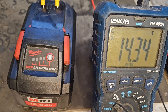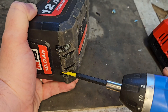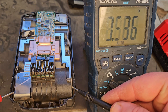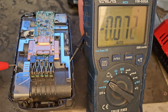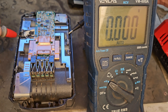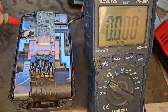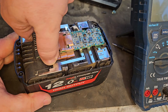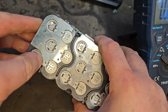The battery is showing a none-too-impressive 14.34 volts. On the first bank of cells to the other we get 3.6, 3.6, 3.6, 3.52 — a little bit lower — then another three at 3.6, and then dead. So this bank has died completely and we're going to have to replace those cells.